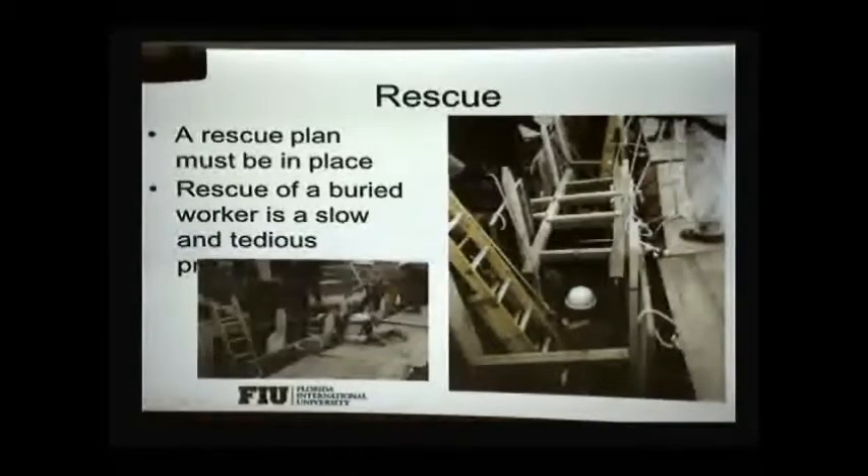You need to maintain a clearance around the opening and set up barricades to prevent people from falling into holes. It's easy to hit underground utilities, so you need to call ahead and make sure you know where things are before digging. There's no fixed width requirement for a trench — if you're going to put a 36-inch pipe, you just need enough room. What dictates the width of the trench many times is the pipe and the area around it that you have to backfill and how you're going to backfill it.